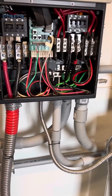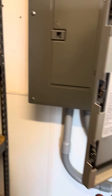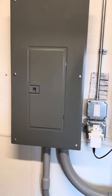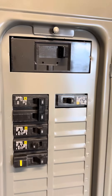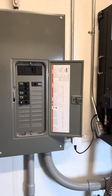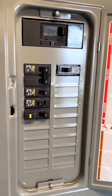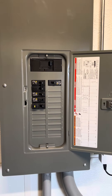With this 15kW inverter, the load output comes over to this panel — it's just a 240-volt/120-volt panel. This is where we feed the lights and outlets. We also have a 100-amp breaker that feeds the house. It's a power panel in the electrical room, kind of separate from the house, maybe 20 feet away. We've got house electrical, lights and outlets, a couple of spares, and a battery tender outside for the generator battery.